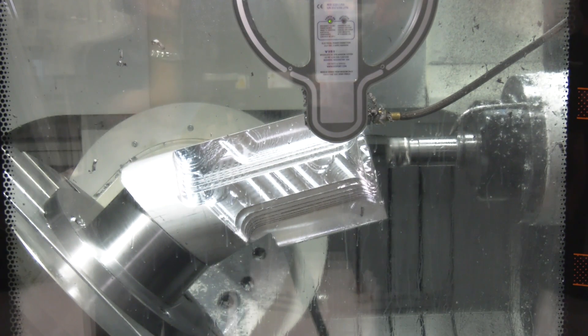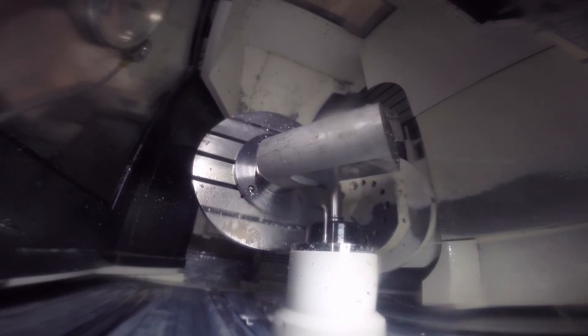If you're machining that quickly, how are you going to get the chips out? Actually this is a really good design point of the machine. The horizontal spindle is excellent for chip removal — chips fall vertically downward, there is a center trough through the middle of the machine, the conveyor takes them out, and the covers are all designed vertically so the swarf exits the machine very quickly.